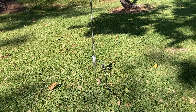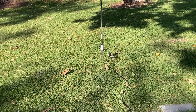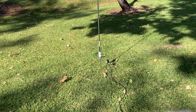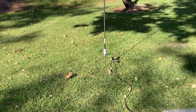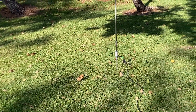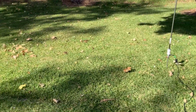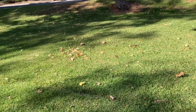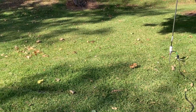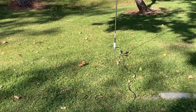If you have an IC-705 and don't want to bring a tuner, then this is not the antenna for you. If you have a tuner — great. If you have something like a KX2 with the ATU, that will definitely tune even on the 80-meter band. One concern is the 60-foot-long counterpoise, which somebody could trip on. If they do, your antenna is going to fall and your aluminum whip could bend.